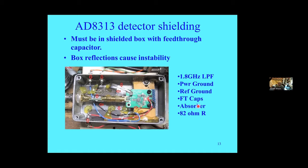There were problems with the box having a resonant frequency, and with a lot of gain, very low-level oscillations would run up. I put some pieces of refrigerator magnet in the corner of the box — that is actually quite a good absorber. It's not characterized as such, so you have to fiddle with it, but it works very well. Then there's the 82-ohm resistor: I accidentally shorted the 5-volt supply on the Arduino while it was running, so I had 12 volts powering things and the ADC converter didn't like that — got too much current in its input. Putting a small resistor in there keeps it from latching up.